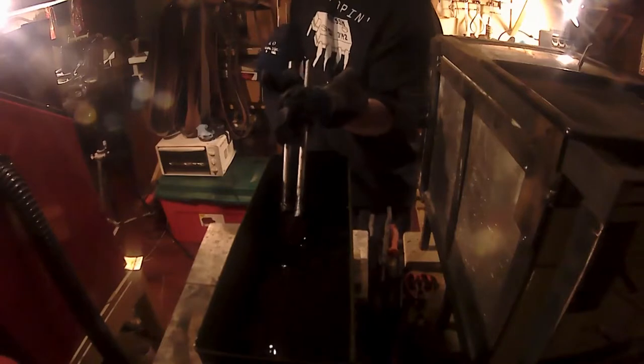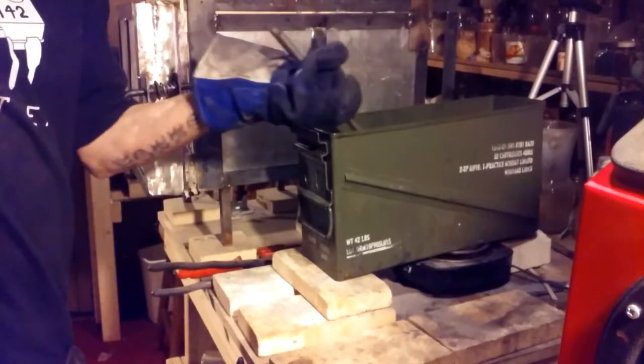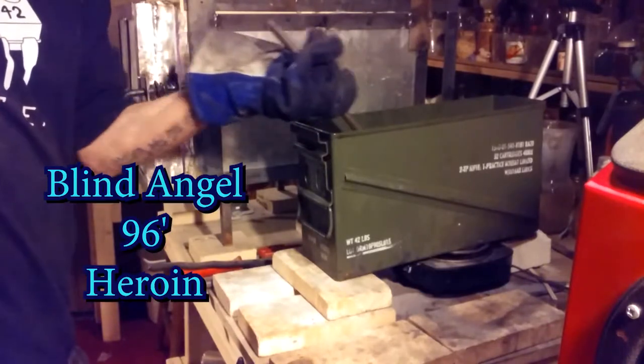So I've done 52100, 1095, 1084, O1, and 80CRV. Each has its own recipe and a little bit different, but they're all basically the same. I've used a propane forge. I've even used the propane torch and just held it over it in the canola oil. Now I'm using McMaster-Carr, the 11-second quench.